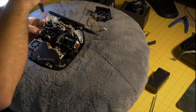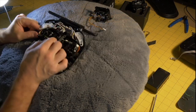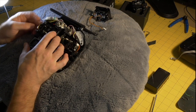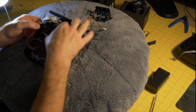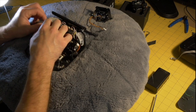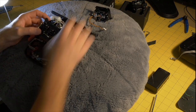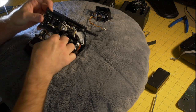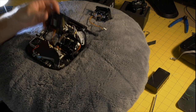After that the gimbal just comes right out. This is actually a really easy install once you have all the pieces available. Having to prototype and 3D print things makes it take a little longer, so I was super excited that Spires FPV already provided at least one of the pieces I needed. When you go to pull the gimbal out, it's going to be plugged into the circuit board with a little six-pin Molex plug — just unplug it, pull it out, and set your gimbal aside. That's the complete uninstallation.